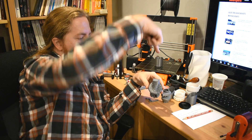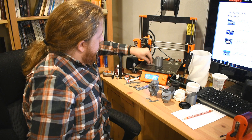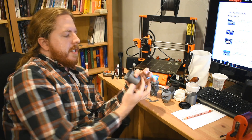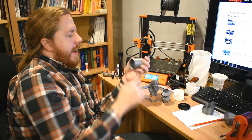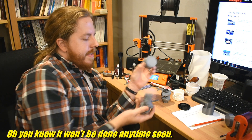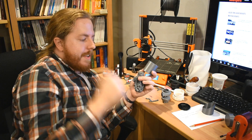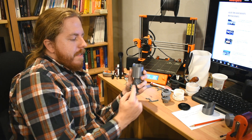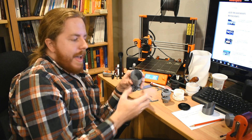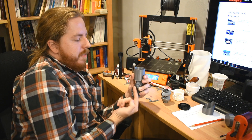There are two main things I'm going to do to this. First off, it doesn't have an in-gate. I want to cast it like this so gravity pulls the metal in. But this isn't going to be the top — the top of the plaster will be up here, which means I need an in-gate. And that's why I printed that — this is just a cylinder, inch and a half by two inches. I'm going to stick this on the bottom like that. Now this is a lot bigger than this, and there's a reason for that. I'm going to be pouring it in such that air can escape around it and go out. There isn't really any complex part of this that needs special venting, but this is my final defense against that. When this is on top, if this finally fills up and it's full of aluminum, this is going to be a lot of weight — a huge mass. This will obviously solidify last, and that pressure will be pushing down, making the air buoyant, want to rise up. So hopefully that'll help purge some of the bubbles.